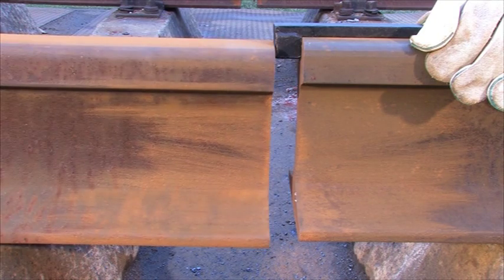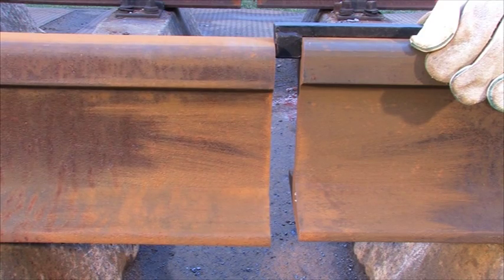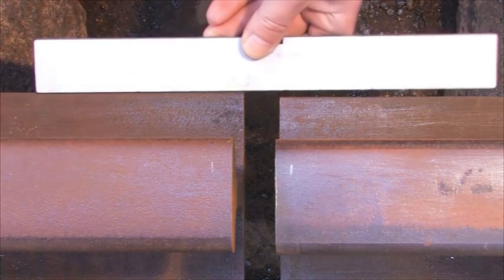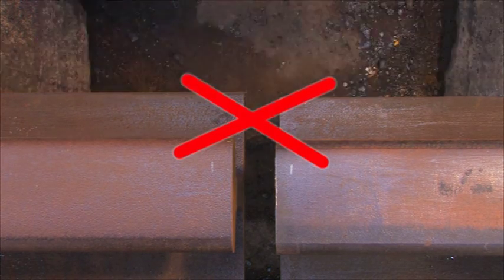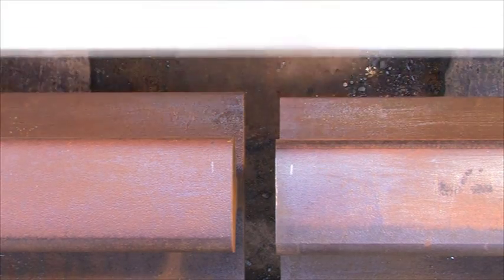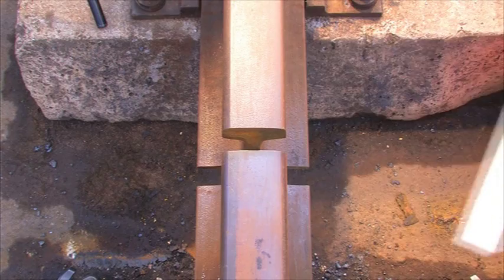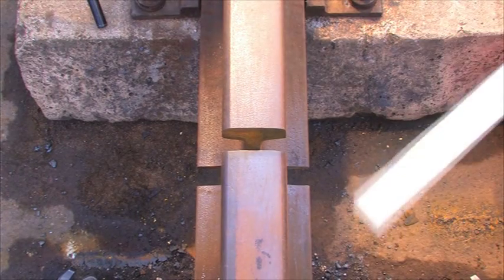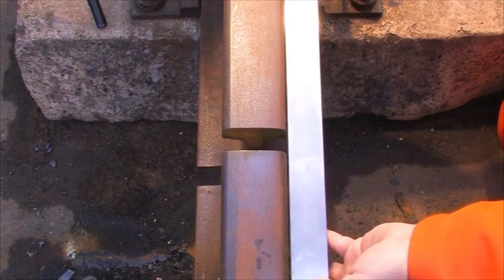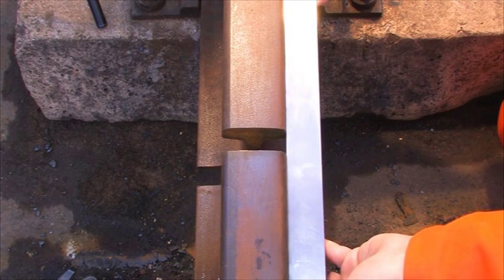Pulling the rails can also be used for the preparation of the welding gap. After creating the gap, the alignment of the rails follows. First, alignment of sides. Outer edges of rail feet shall run in even line to each other. Mismatch is not allowed. As well, the straight edge shall fit along both running flanks with no split.